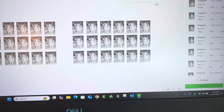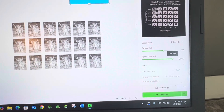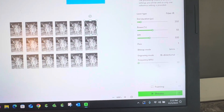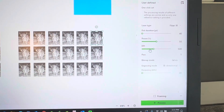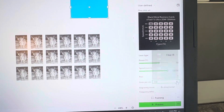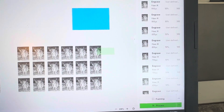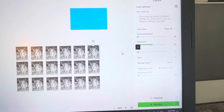If you were on a vector, let's pull up a vector quickly and set it to engrave. On the vector here our speed is backwards — on top is 10,000, and when we select this down here, 10,000 would essentially be all the way over here to 40. For the lines per centimeter we would set this to 300, which is the highest we can go, and then you come down here and set it to 500. We can go all the way up to 1270 and as low as one — so this is going to be the amount of pixels.